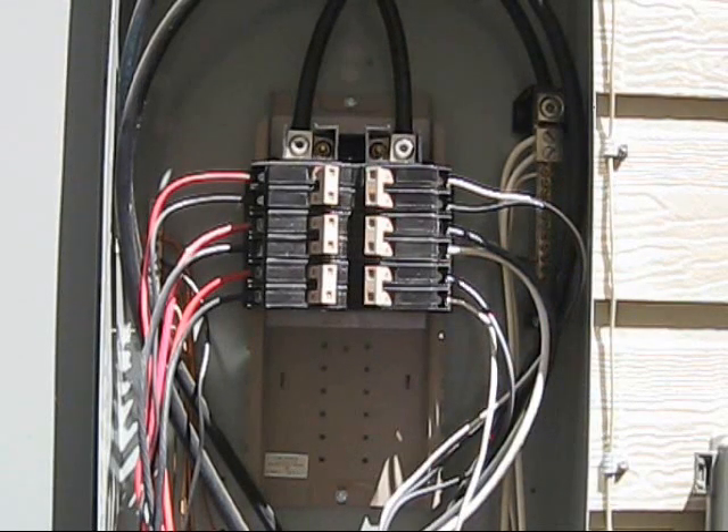You want a two-pole 30 amp breaker. What I guess they're trying to say is that two of them are connected by a single pole — but it's called a two-pole 30 amp breaker. Now, a lot of people have asked me about the 30 amp — why am I using a 30 amp when the instructions I posted said right there in plain sight: 220, two-pole 20 amp breaker. Well, on the website when I bought the item, it said that you could use a 30 amp breaker.